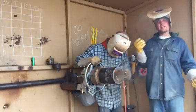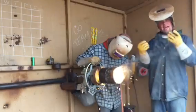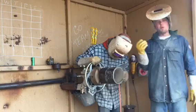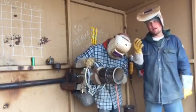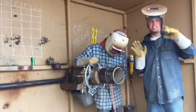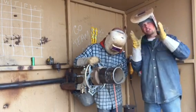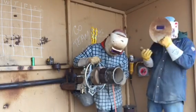Okay guys, this is good — because what it is, he gapped it just a little too big on one side, and now he's gotta figure out how to fill it up without leaving huge hangers on the inside. It's important — you gotta know how to do stuff like that. When you've got a big gap like that, don't necessarily pause and hang out in one spot, just run it. Whatever hooks onto each side, that's what it is. Then later, once it starts to pull those sides in together because you've been adding weld, you can actually run it just like a bead.